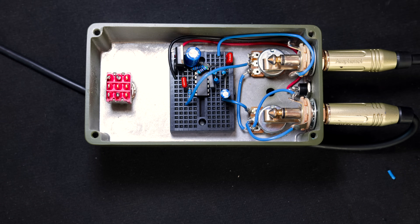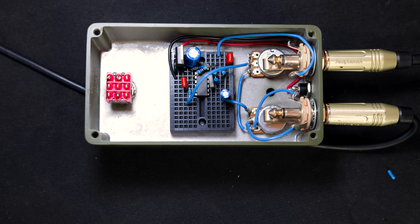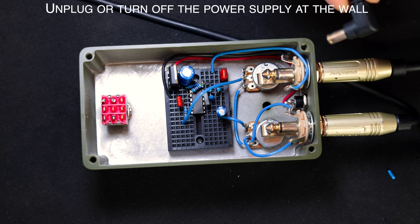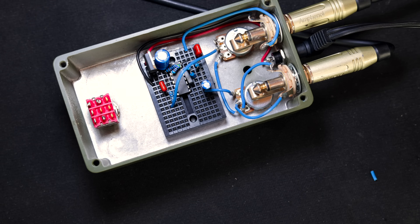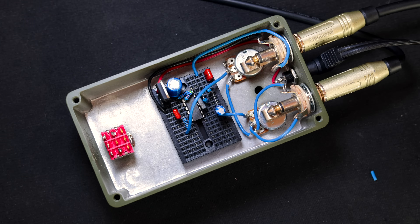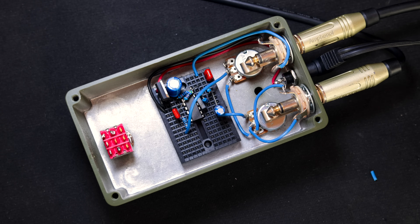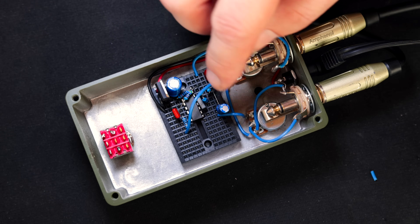I've added a few mods to make it really interesting and a bit more guitar-esque. This is essentially the engine of this circuit — so let's do the test. The way I like to check it is I get that power supply charged up, then unplug it, hit my guitar, and then just plug it in. See how I heard that little bit of fuzz? Always do that test first where you just have the power supply charged but not permanently plugged in. Always double check all your connections especially those power connections — make sure your 9 volt is going to the right place, that the chip is orientated correctly and that your capacitors are also orientated correctly.